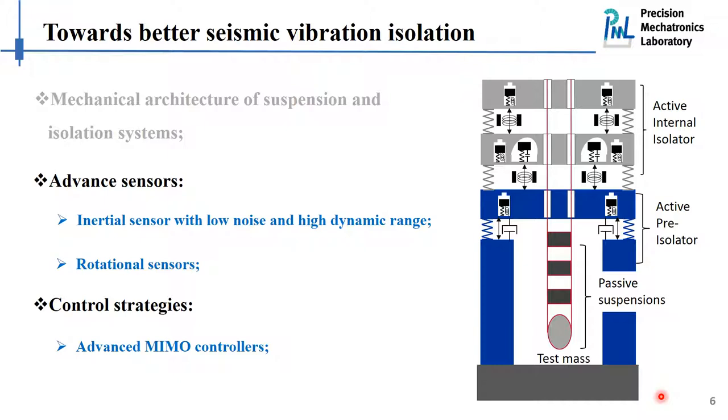But this is not the case for the sensor part. The current commercially available inertial sensors cannot fulfill the requirements for implementing very good active isolation performance in the low frequency range. We know that the best control we can achieve is to push the residual motion of those platforms to the noise floor of the inertial sensors. This is why we want to develop our own inertial sensors with low noise and high dynamic range in the low frequency range. We will also see later that inertial sensors cannot distinguish translational motions and rotational motions in the very low frequency range, which is why we want to design rotational sensors to liberate inertial sensors from this tilt coupling.